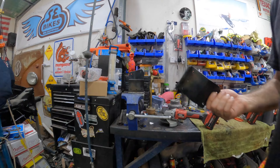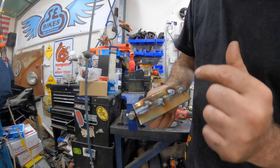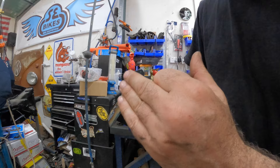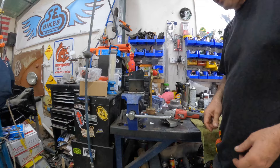Okay, so we're on the bench — we've got both brackets. You can see the extra little piece I've put in, welded on both sides. I've v-prepped the two pieces so you've got good penetration, because once we grind this back we don't want a weak joint. Really important to v-prep either side. We'll grind these back now, then re-drill our holes, repaint, and we're good to go. Let's get the grinder onto it.